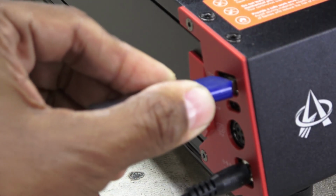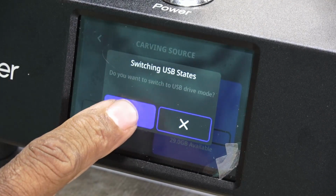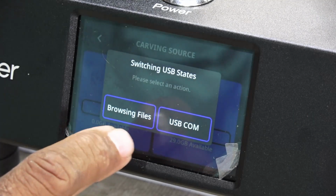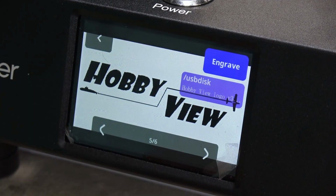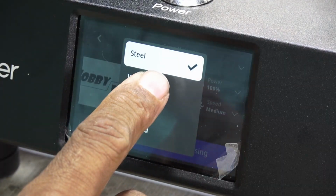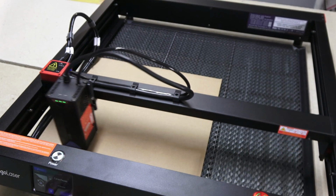For a quick start, you can plug in a USB drive. There is apparently a built-in SD card, but I want to access the thumb drive, where I can load a graphics file to engrave. There we go, my channel logo. Hit the engrave button. I noticed material options, so I chose wood. There are other options like quality, power settings, and number of cutting passes. Press start processing, then engrave.